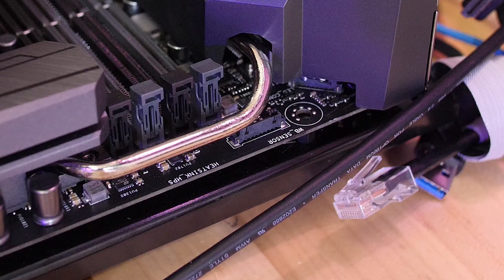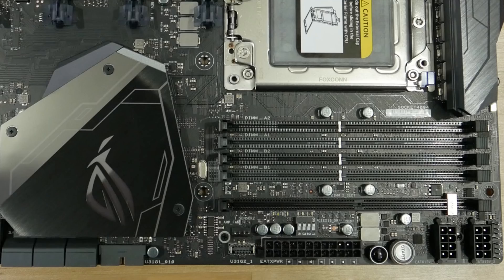In addition to those PCI Express slots, we've got a PCI Express x4 slot and a PCI Express x1 slot. Those two slots go through the chipset, so that's a PCI Express 2.0 interface. At the top edge of the motherboard, we've got a WB sensor input — a proprietary connector that lets you use a water-block sensor or other input-type sensor devices. Consult the manual for usage on that. We also have a 5050 RGB header connector, two 4-pin fan headers for the CPU, two 8-pin power inputs on the other side of the memory slots, a power button, reset button, 24-pin ATX power connector, a DIP switch, another 4-pin fan header, an analog temperature input, and a front panel USB Type-C input.